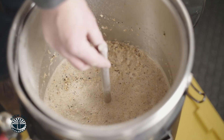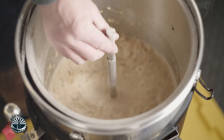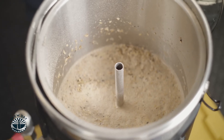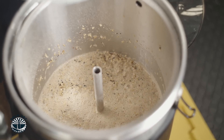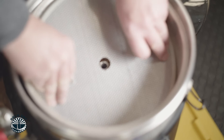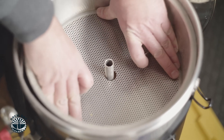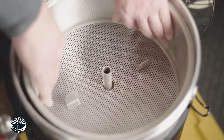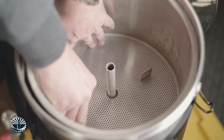You see all the dust on top here? This is why it's called the grain stopper — it keeps any grains from falling down that pipe, which could clog the pump. But now we're going to go ahead and take that out; we no longer need it. We're going to grab our top grain screen. Keep in mind this has a seal as well, and notice all that powder around the edge — that's going to do the same thing the water did previously. Come in at a little bit of an angle, get it in, and make sure the pipe comes up through the middle.